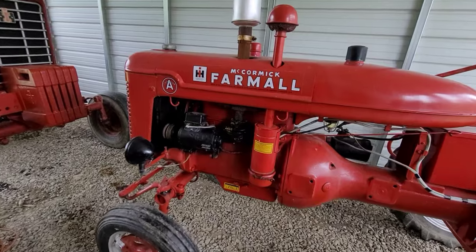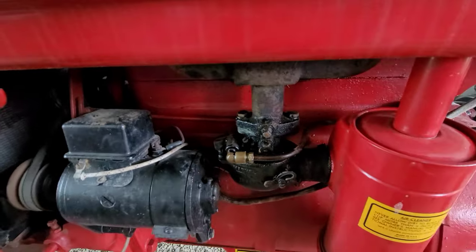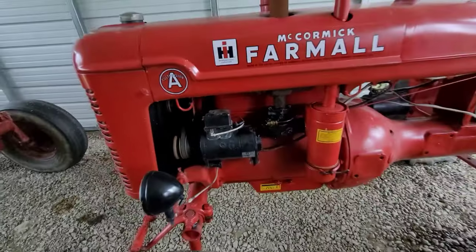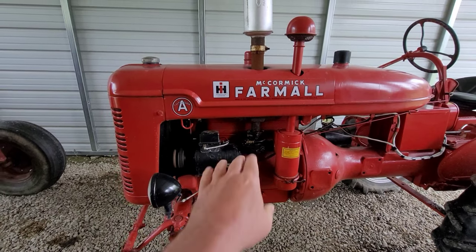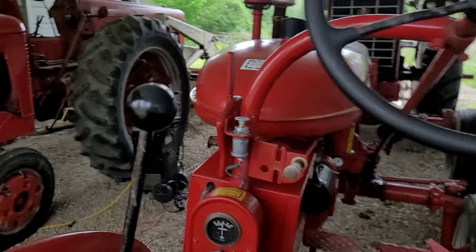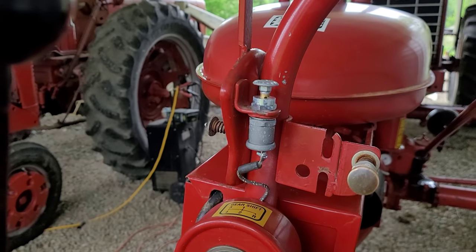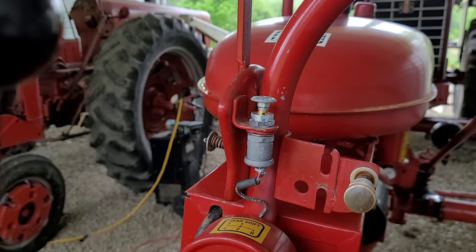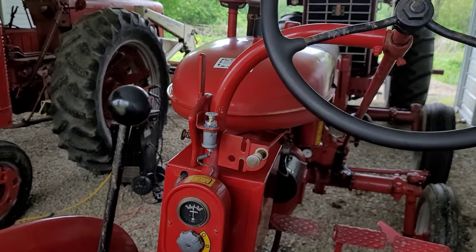Yeah, she's running. Checking those fittings, making sure I got them nice and tight. A lot of people put Teflon tape and stuff around there. That's a no-go. Get any particles and stuff down in your jets, no thank you. So I did end up putting the better switch on there. I do consider these a little bit better. They're pretty good, about $40, but they last longer. They can just take the heat a little bit better than them $10 ones, or probably now $20.